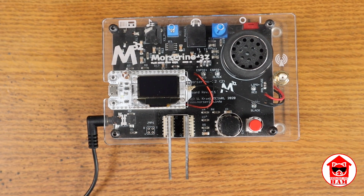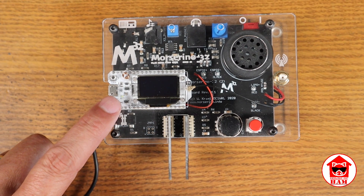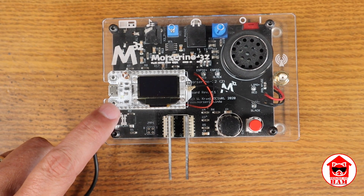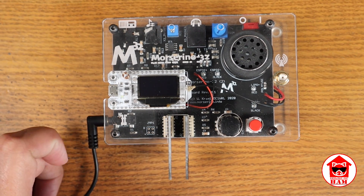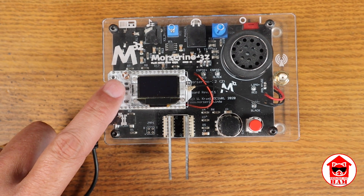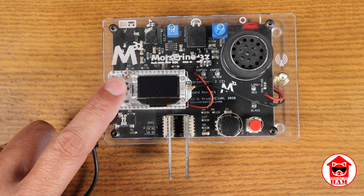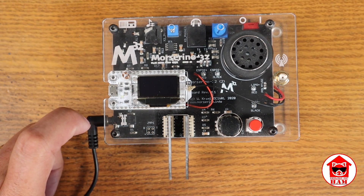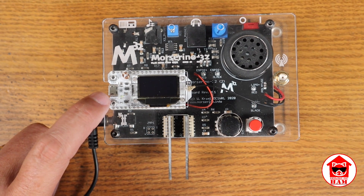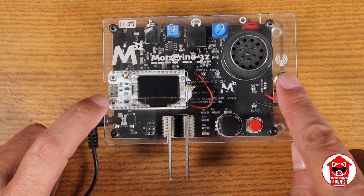Let's go around this thing and talk about what the different pieces are. You've got the ESP32 module — you'll hear a lot of people call it the Heltec module, because that's the brand name. It has the ESP32 microcontroller as well as Wi-Fi. That little coil is actually the Wi-Fi antenna. And then it's got long range, or LoRa.